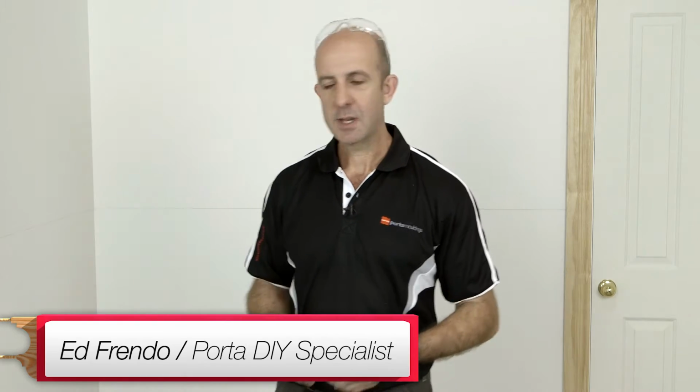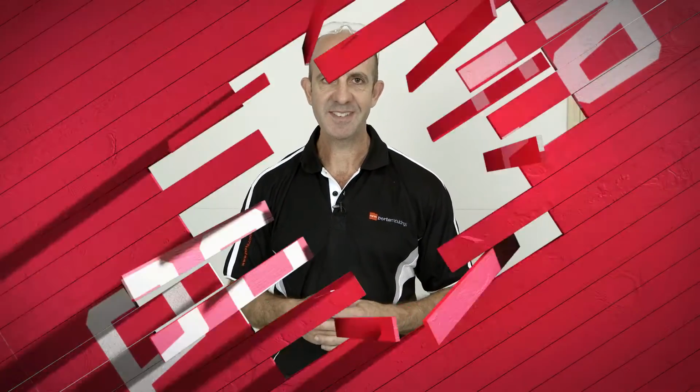Now before we get into the skirting, I just want to explain to you what it is. Essentially it's just a decorative board that goes between the floor and the wall. It just covers that gap at that junction. Now as far as the size goes, it's up to you, but generally the skirting is one size larger than your architrave. So in our case, we've used a 90mm architrave and 138mm skirting.